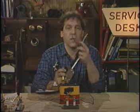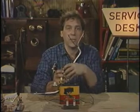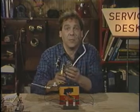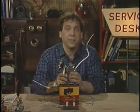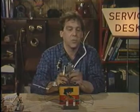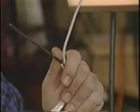The white and bare wires are all connected to a common ground point at the service panel. The bare wires never carry current and aren't part of any circuit — all they do is connect all the metal parts in the system to ground. That way, if anything accidentally makes an exposed metal part live, the safety ground wire completes the circuit, blowing the fuse or circuit breaker. For safety you can't ignore them, but for circuit purposes you can ignore the bare wires.